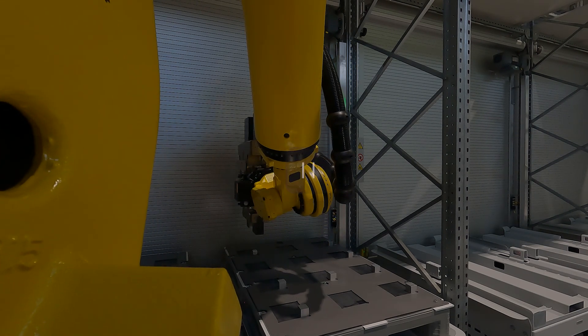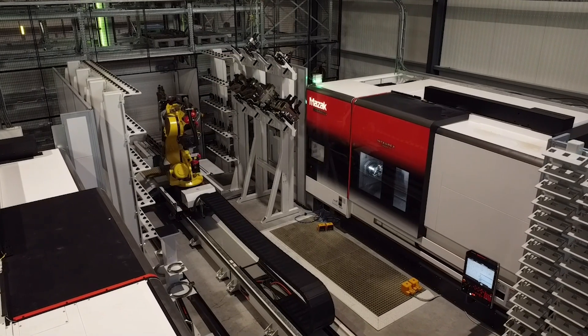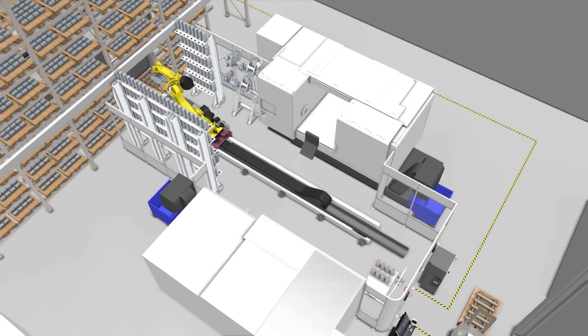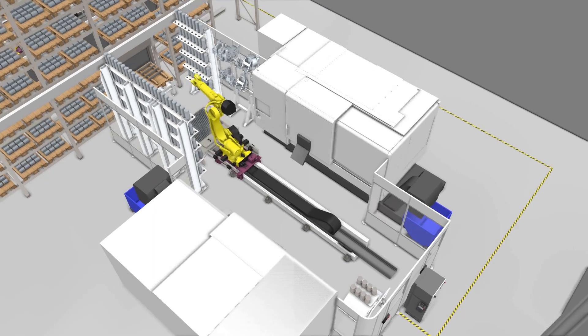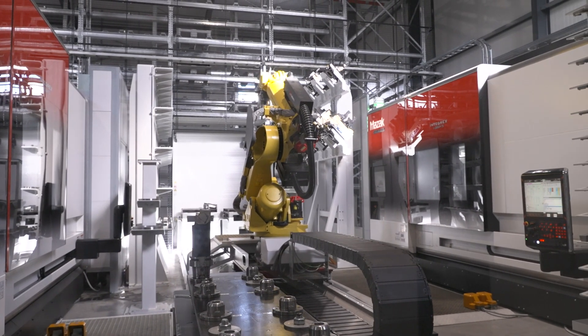It's not just a milling section — they have a turning section as well with two Mazak Integrex machines, which are one of my favourite machines. There's nobody around; the robot grippers can change themselves, and they have a full tool library which the machine checks to confirm the right tool is in place. If it's not, it will go and fetch it — and they're actually going to add an AGV to handle that too. This entire factory could be run by one person who is literally just setting machines.